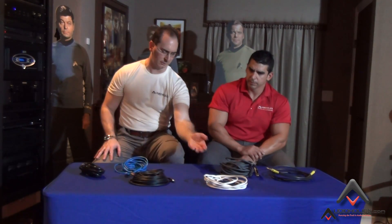If you can, run balanced cables to your patch panels and to your subwoofer locations. Always run extra speaker cables — if you think you're running four surrounds, run double the cable; cable's not that expensive. Do run CL2-approved cable that can go behind drywall safely. Run a couple of pairs up in the ceiling in case you want to go with Atmos — two in the front, two in the back of the room. It's always good to have more than less.